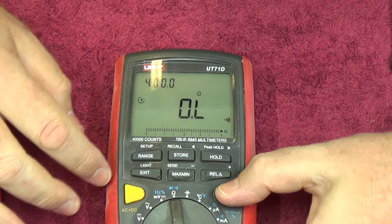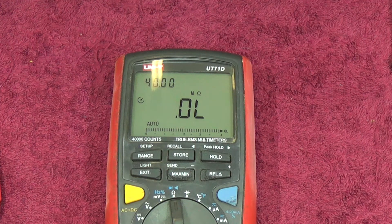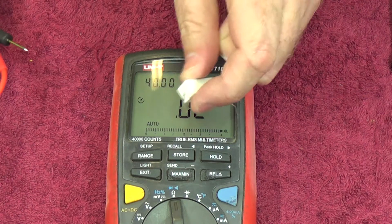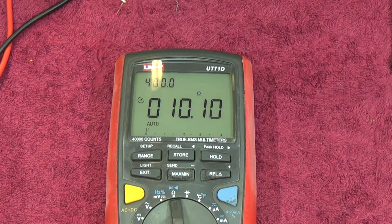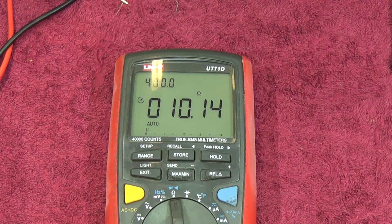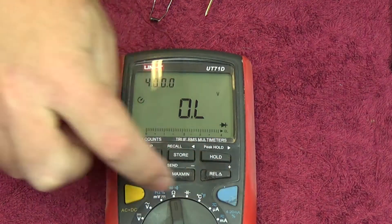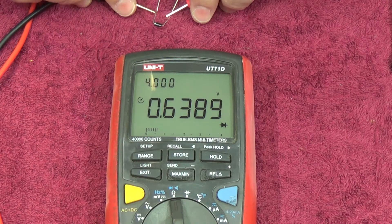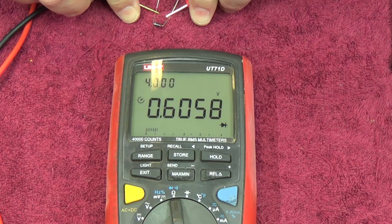Now let's have a look at one of my good old resistors - this is my 10 ohm resistor. Let's hook him up. We're expecting about 10.1 - it's reading 10.14, so it's reading a bit higher, but not too shabby at all. Something I'm interested to see: something Fluke's always done well is the diode test function where you get a very distinctive beep on the forward measurement. With this one, no distinctive beep, but you get your forward voltage of 0.6. We're expecting 0.5 to 0.7, so happy with that.